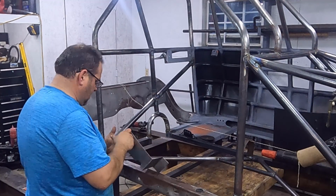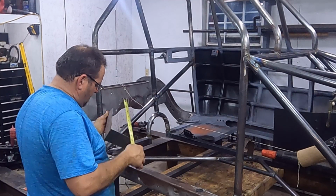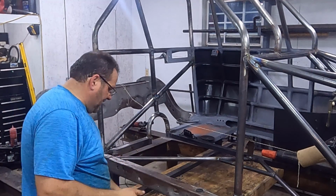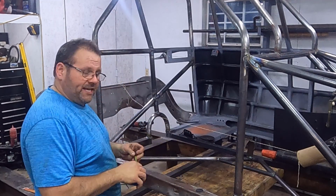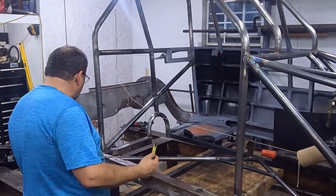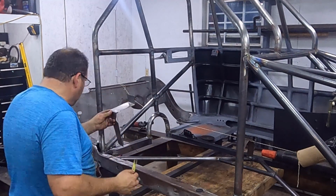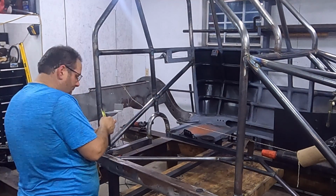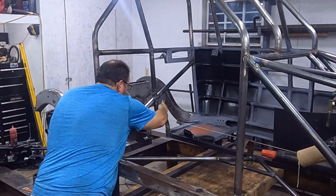Here's my measurement. And this is 8.5, 14. Yes, this is like a 16-inch piece of steel. And it's going to be 16 inches by 41 inches. Okay, well, why 41? All right, this cage is 40 inches at the base, center to center of tube is 40 inches. This over here will go to the back of the cage, okay? All right, so I'll notch out and take that back so that it's going back to that back wall and over that tube.